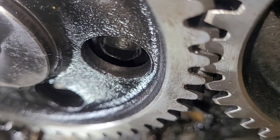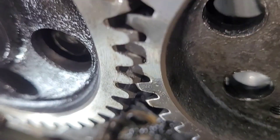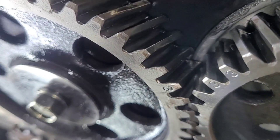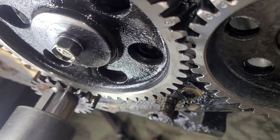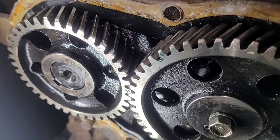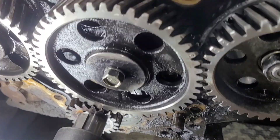The point is that there is a center sprocket or gear. There is a crank gear that drives that center gear. The center gear controls the timing of that balance shaft, and most importantly, the injection pump, because my forklift is wicked out of time.